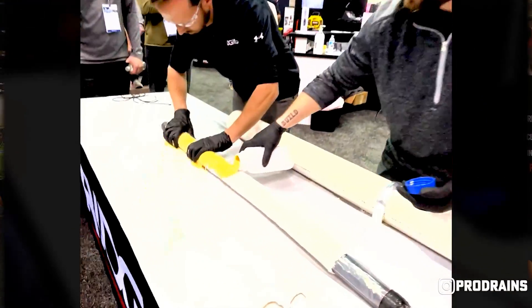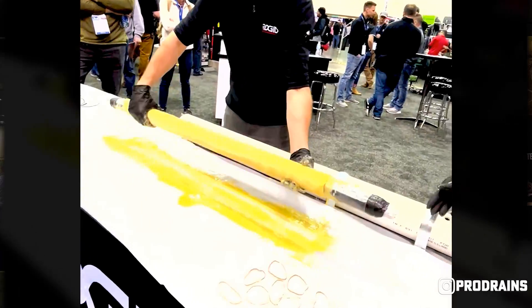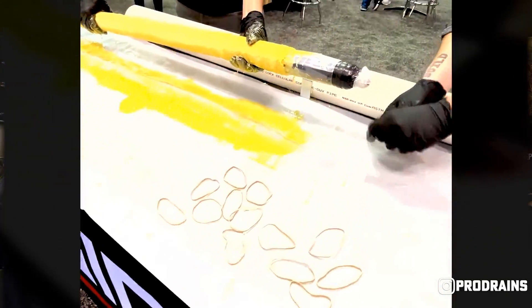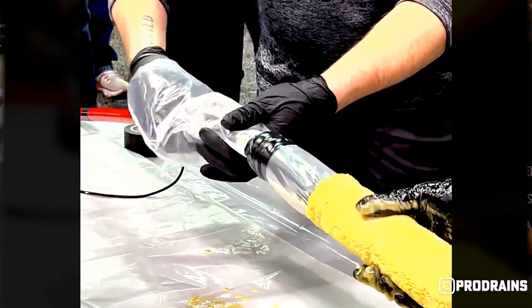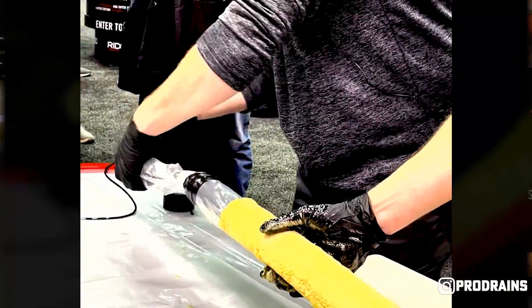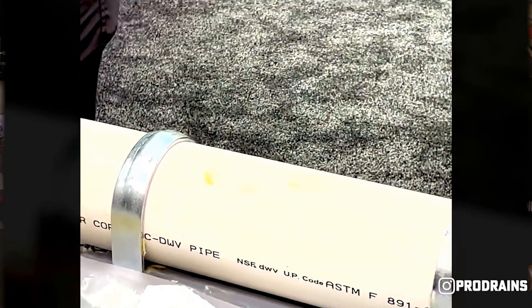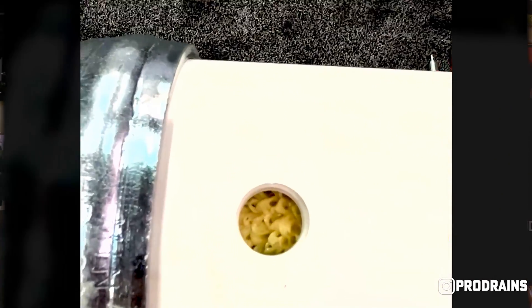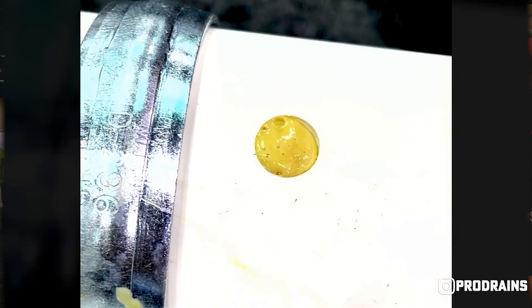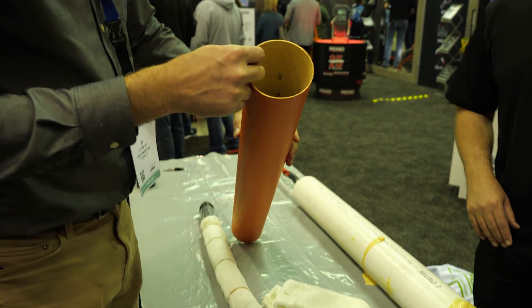People can do two or three patches in a day. The inflator comes in a few different sizes — you can go three to six feet, depending on what you need. And you can see right here, these push rods and inflators are very flexible. You can patch a P-trap, you can patch a 90, and you can also patch a transition — if you go from four to six inch or three to four inch, you can patch it. These things can maneuver around, so you can either push it into place with a push rod or actually pull it into place, whichever method is easier.